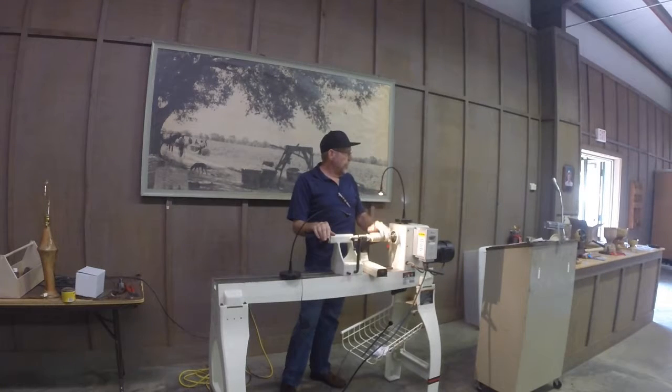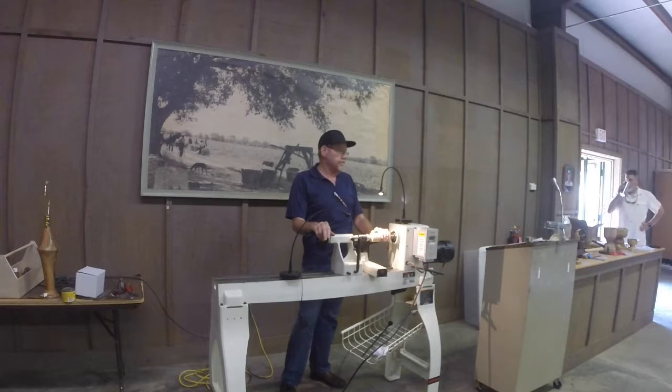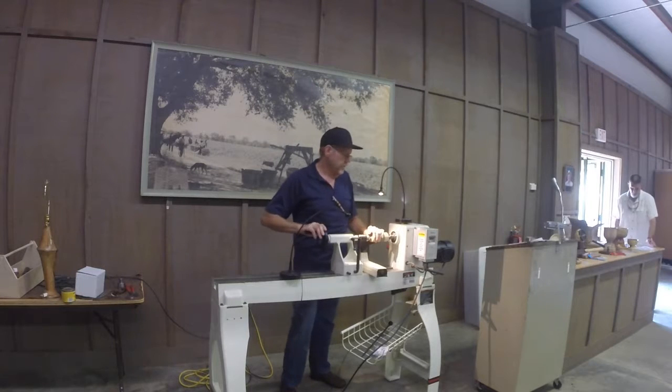And Bob, you tried the brass from the key companies. It just doesn't pop. To me, it's just a little dull. Yeah, a little dull and doesn't have much sheen to it. What I have found works pretty well is you go to a place that cuts a lot of aluminum, like an awning place or one that makes pool enclosures and stuff, and get their aluminum shavings. Now those look pretty good. It's a good metallic shaving. Somehow with the brass keys, you put it with CA or fiberglass or anything else, by the time you turn it, it gets dull. It just looks horrible. It just didn't look good.